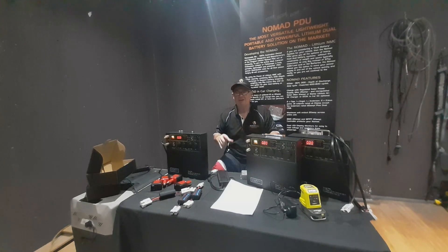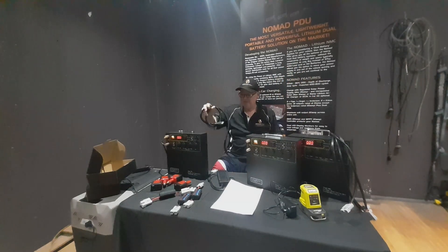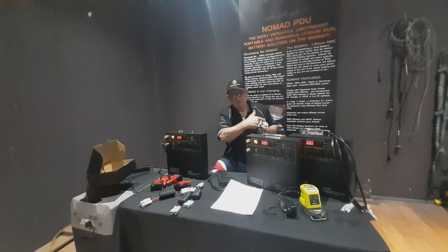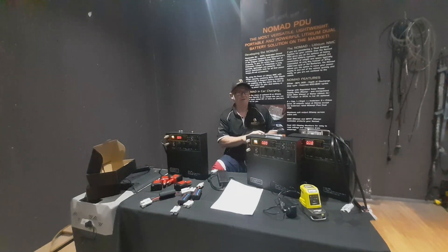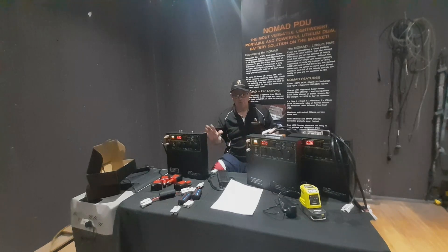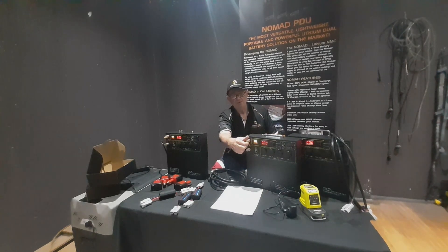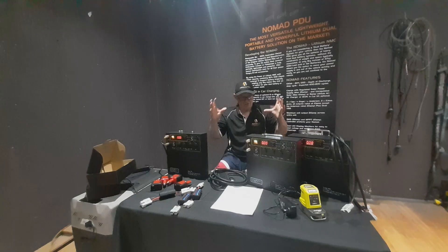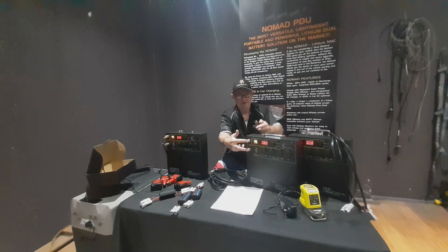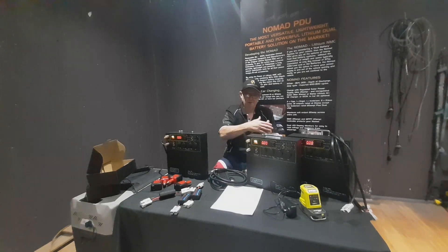The reason is it's unregulated. If you connect directly to an alternator without a fuse — worst case — or even with a 40 or 50-amp fuse, the alternator is capable of putting out 50 amps or more, and the maximum you can charge the Nomad at through the regulated input is 25 amps — so you will kill the unit. That's why you must use a DC/DC charger. This is a Ciga DC/DC — it plugs into the cigarette socket, this one's 10 amps, and it regulates it to 10 amps going into the regulated input. You can also get a 5-amp one for any cigarette socket. If you want to plug your solar panel in as well, just remember the maximum going into the MPPT is 10 amps, leaving 15 amps available at the regulated input.